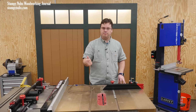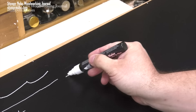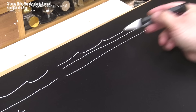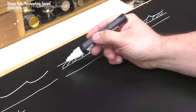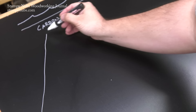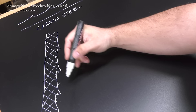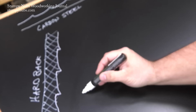As for steel, you're likely to find carbon steel and bimetal bandsaw blades when you go shopping. Bimetal blades are more expensive because the toothed edge is made from a harder strip of steel, so they're more durable, they last longer, and they're more commonly used for cutting metal. Carbon steel blades are more economical for woodworking and they stay sharp plenty long. You'll also find hardback and flexback varieties. Hardback blades are heat treated all the way through the steel, so they're stiffer and they tend to drift less when cutting straight lines such as ripping boards, resawing, or cutting joinery on the bandsaw.